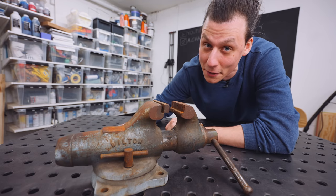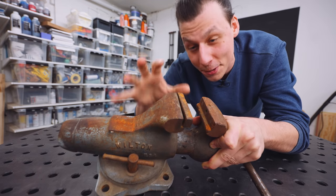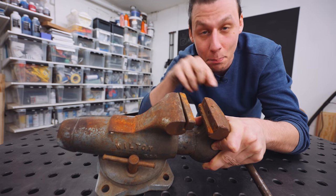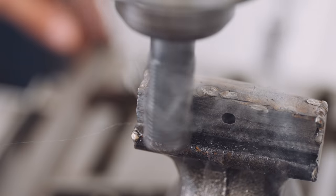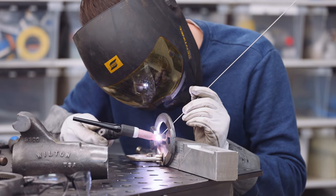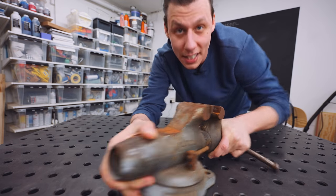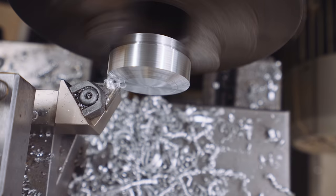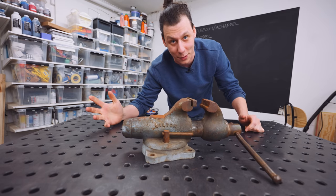And man, there's a lot of stuff to do here. Apart from being really rusty and missing one of the jaws, all four of the screws that are meant to hold the jaws in place are either broken off inside the casting or just stuck. So we're going to have to do some machining and welding to sort that out. There's also a broken piece in the bottom casting that we're going to have to try and weld, and a piece in the back that is entirely missing, so we'll have to machine a new one. But before we do any of that, let's take this whole thing apart and see what we have to work with.